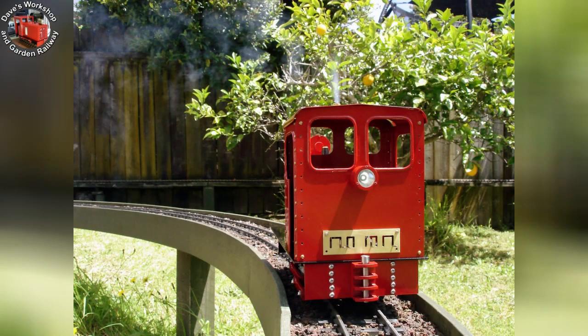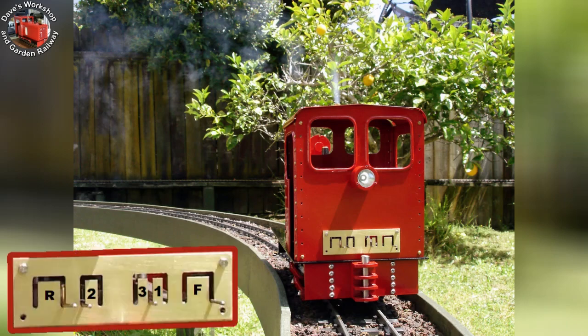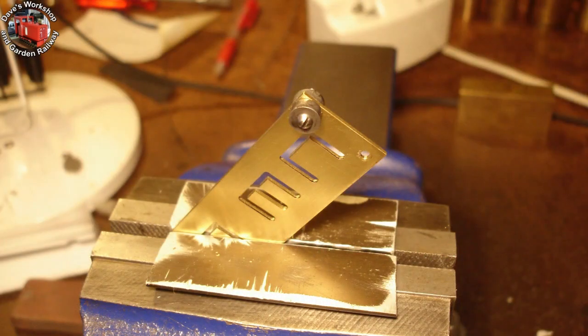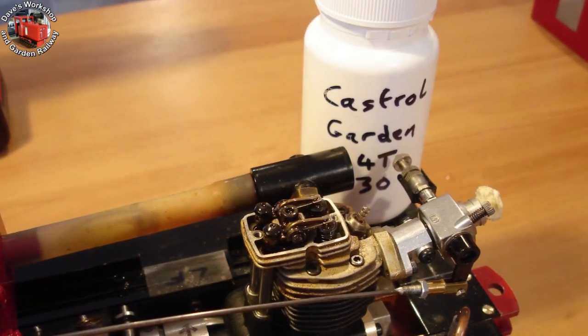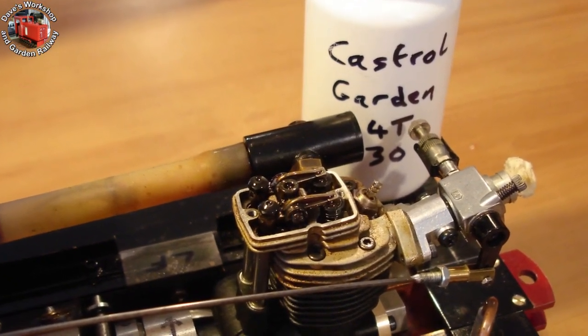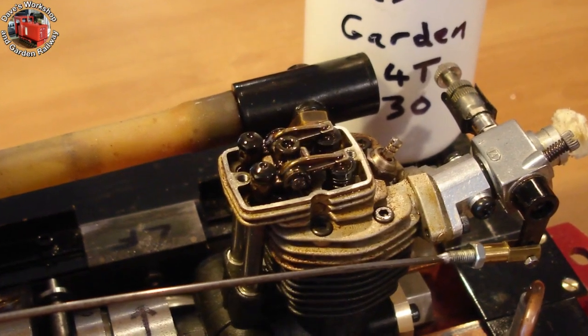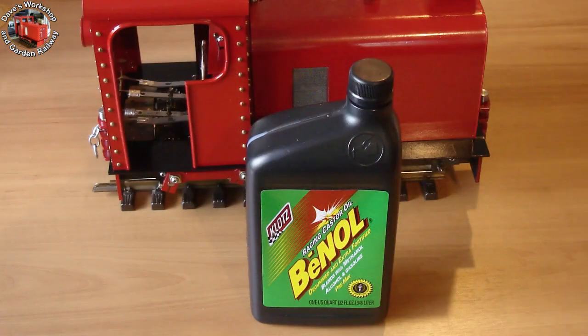Shakedown test on the line — the loco is in reverse and in second gear, at a scale 10mph, a nice mainline speed. Here's a close-up of the selector plate; I decided to just round off the upper corners. I liberally oil the valve gear with single weight lawnmower engine oil — it will flow down the pushrod tubes to the camshaft and skew gears. I'll give fuel mixing a go next year; I've just bought in the oil and next I'll need to buy methanol.